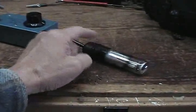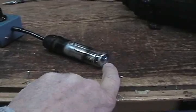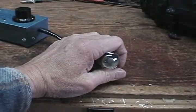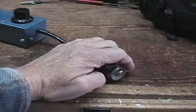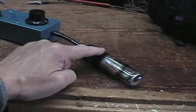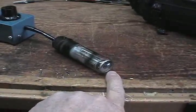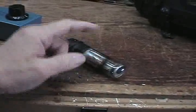This is just an indication, because when you buy these tubes and put them in a tube tester, the tube tester will show you the emission of the tube. But that has nothing to do with the green phosphor. What happens is the green phosphor, after a while, is gone — it gets poor and doesn't give any more phosphorescent green glow. So even though the tube may test good in a regular tube tester, it doesn't mean that the tube out front is going to show a bright green. A tester like this is really what you need to see if it lights green, because your average tube tester will not put enough voltage on the target to show up the green.